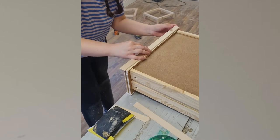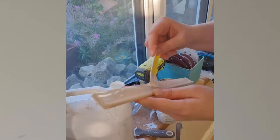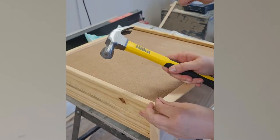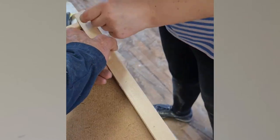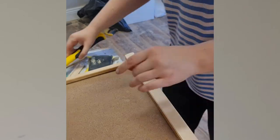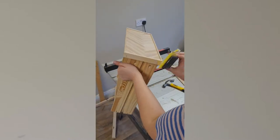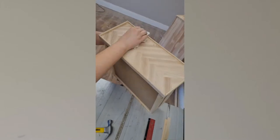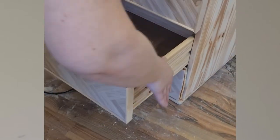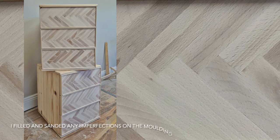I'm just dry-fitting to see that it's all working, because obviously the last couple of pieces are the most important. Then I went in with glue and pin-nailed them in — probably about four on the bottom, maybe five, and three on the sides. If you hammer the pin nails in far enough you can put filler on and sand it back to disguise them. I'm cleaning up any glue that got on the front, and now the moment of truth: checking that they all fit. My dad had neatened up the cuts and given some extra room so the molding would fit — and it looks really good.